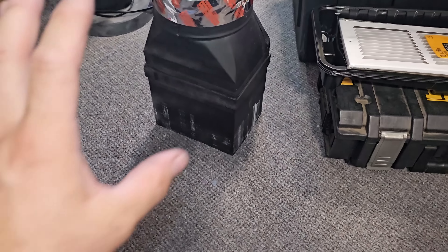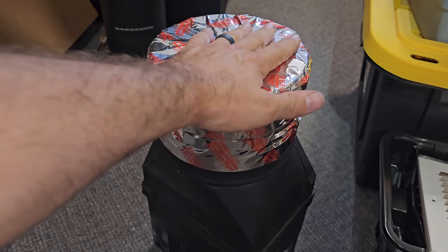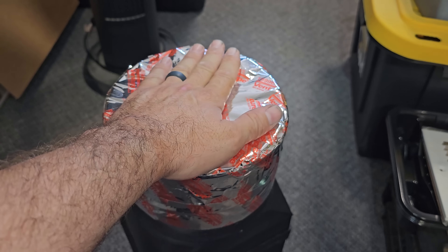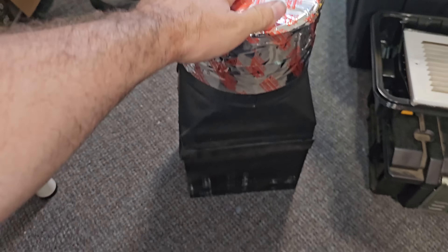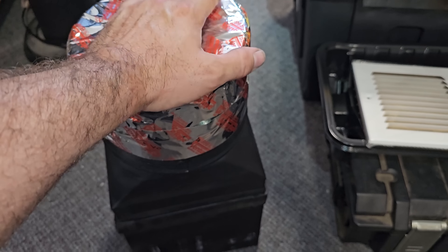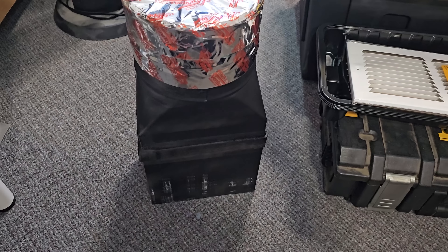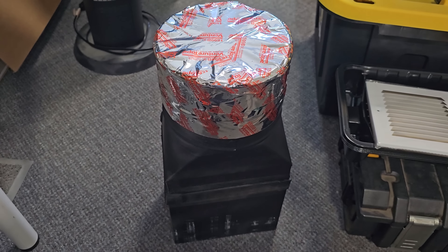I'm not connecting ductwork to these boots yet, I'm just cutting them in now. This isn't ideal, but I used a start collar, bent the tabs in, and taped it shut. This isn't going to cause any real thermal protection — it's going to slow heat loss down slightly but not very much. The biggest thing is it's going to keep the dust out from the attic. My existing system is oversized — it's a four-ton — so a little bit of heat load isn't going to be the end of the world. For now I'm just cutting in the boots, putting the registers on, and taping them shut to keep dust out.